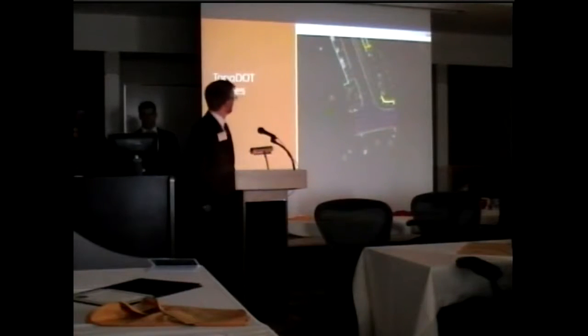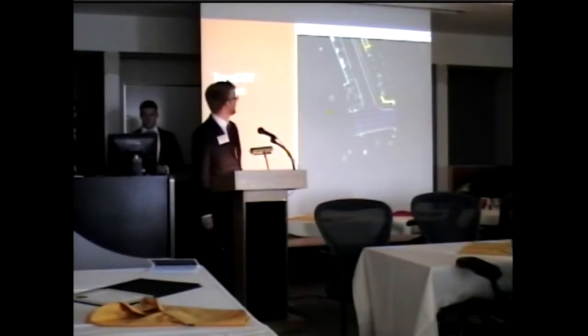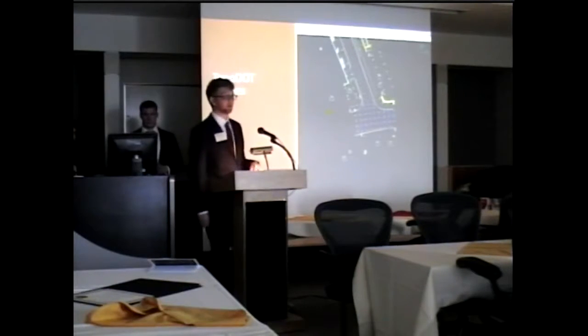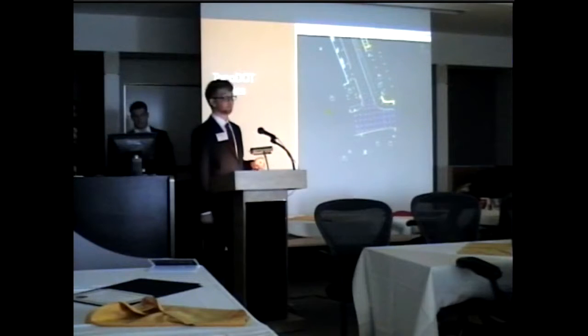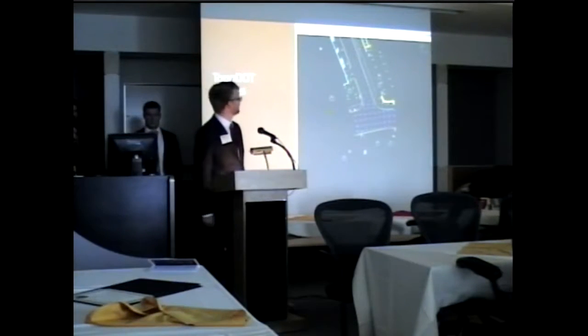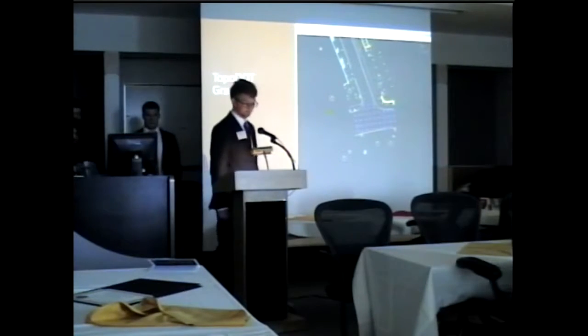Next slide. So here are just two quick ways on how we got grades for our DTM. There's a grade tool called elevation along path, and what that does is allow you to have a uniform grid like the purple lines down there across the roadway. Or if you just want to get grades on the bottom of a hill or something, you could draw a smart line and then drape it on both ends to either the top of the grass or the bottom of the point cloud, which would hopefully be the bottom of the grass, or you can drop it to an average density location, whatever you prefer. We usually drop them to the bottom, so that way that would be closest to the actual ground.